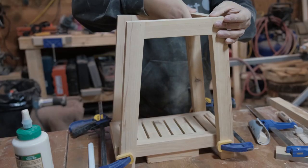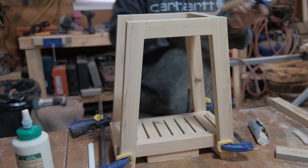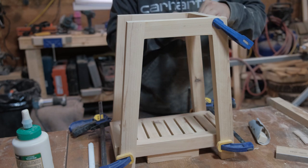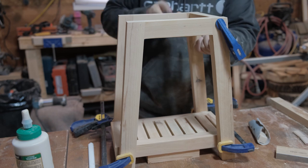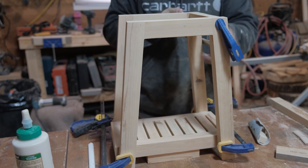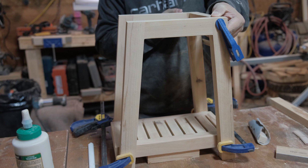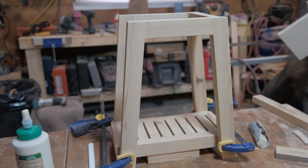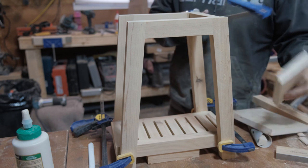I added a 1-inch space for the bottom shelf section. Instead of marking it on the legs, I ended up just using a 1-inch spacer on each end to give me the height I needed. And I ended up gluing 2 spreaders at the top for more support.